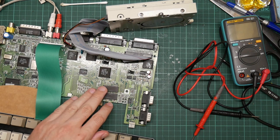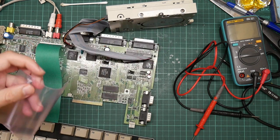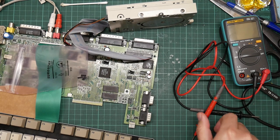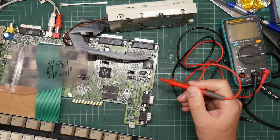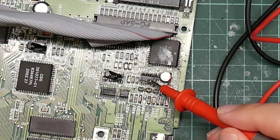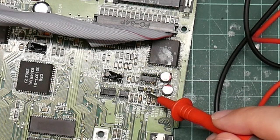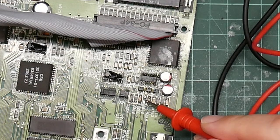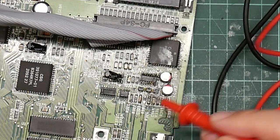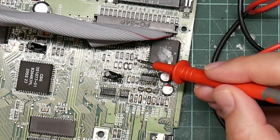It's 2 weeks later. My new op amps have arrived. While waiting for these things to show up, I have reviewed the footage and I now have a much better idea of what's going on. Putting this chip on upside down has caused a dead short through the power rails, which is plus and minus 12 volts.